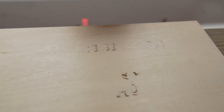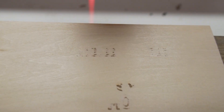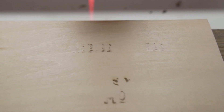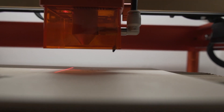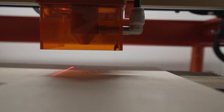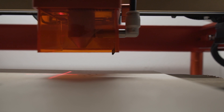I had to stop it — the engraving is definitely not powerful enough, or it's going too fast. I realized the problem: I had my kickstand down, started setting the height of the laser, and then forgot. The laser is way too high for the material — that explains it. I'm going to actually set the height of the laser this time and run it again.